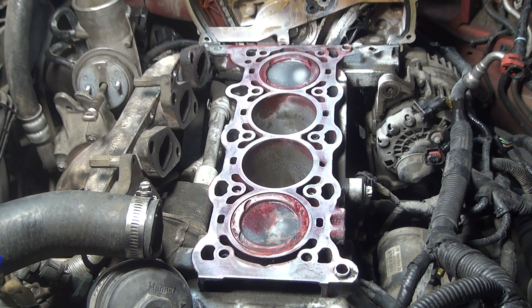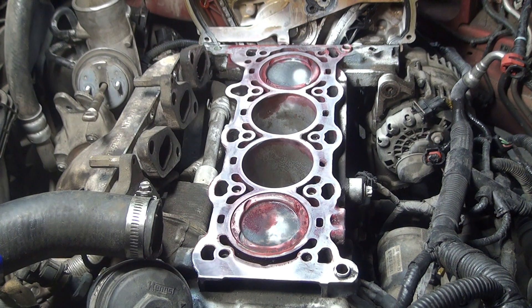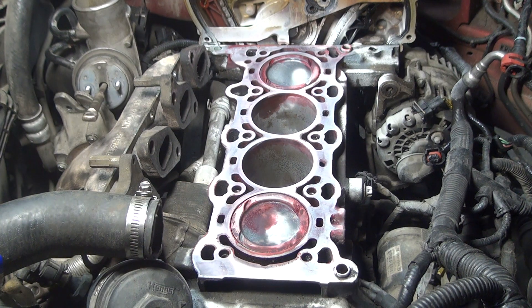I worked in a machine shop for a while where they had a magnetic Magna-Flux machine. Not sure exactly how it worked, but basically after machining a part it went through and detected cracks. This at-home version is fairly expensive, but the cans are good until 2027. I'm going to charge the customer for the cans as part of the cost of doing business. Now I know this block isn't cracked, so I can throw a head on and send it out the door confidently.